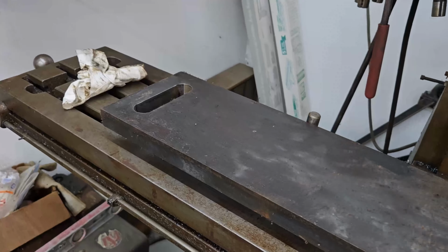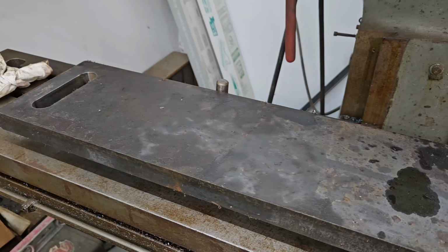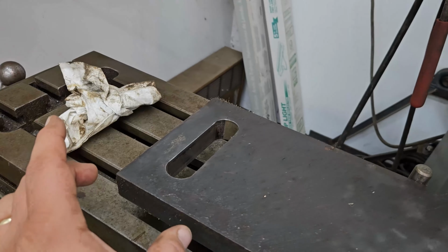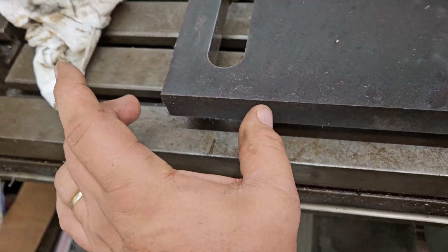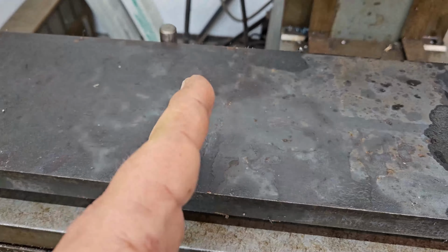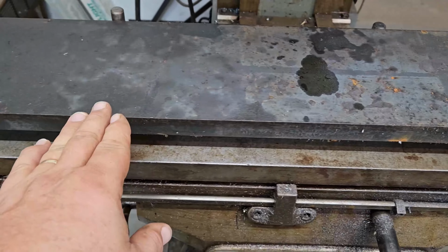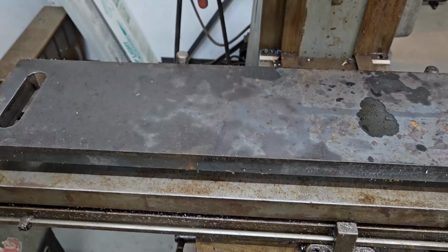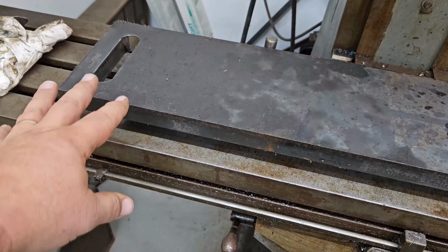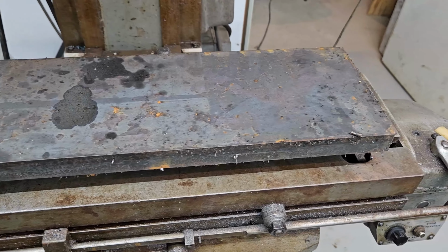And to do that, we're gonna mark off this end of the vertical part of the wedge for the area that we need for the mechanism, and then 8 inches for the beam. And that's the minimum that we have to mill. We may mill just a little lower, just in case I have a little more play down here than I think with the mechanism. I want to make sure I have enough traversing from side to side.